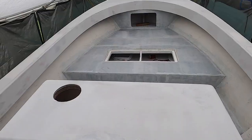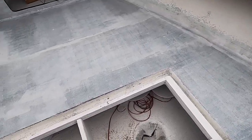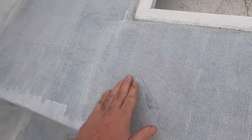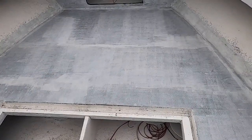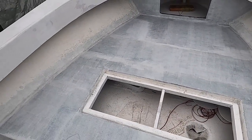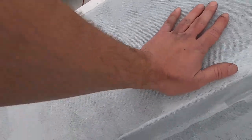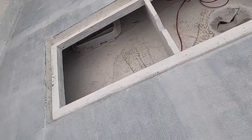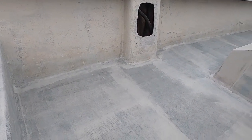We're making progress in the right direction. It's now the next day — about 12 hours since we rolled the primer on. Something's showing through. I'm going to roll another coat of primer and give it a really light sand on the floor to knock down some of the high spots, then come over and put paint on it. I think we're going to roll out some primer and get her going.